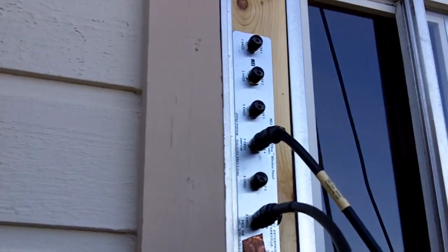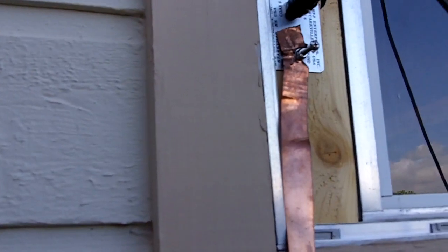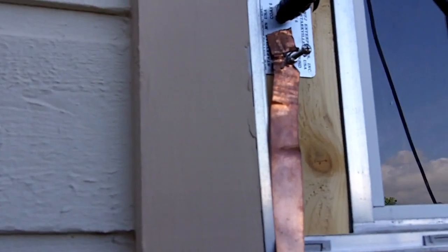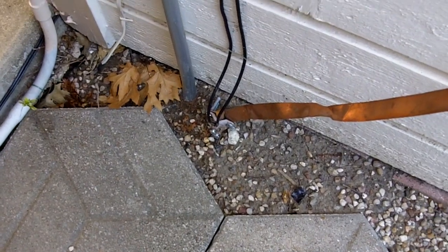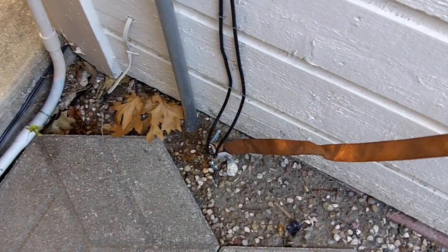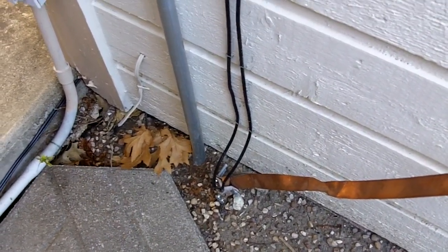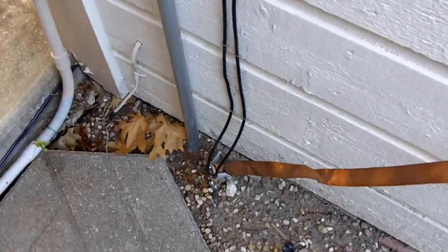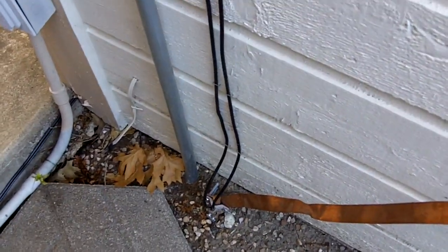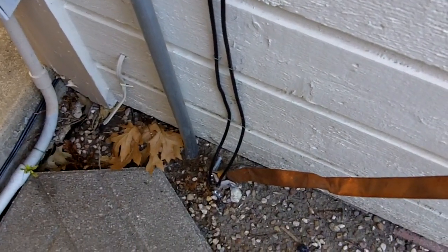There's the pass-through — got a bunch more ports I can use. And you can see I attached a copper strap to the metal there on the pass-through. That copper strap goes right down here to a ground rod. And you can see the other two grounding wires coming in along with the copper strap — one of them goes through the long wire box and the other one goes through the mast, just to ground that out to what the Comet is attached to. So we've got a good ground right outside the shack.